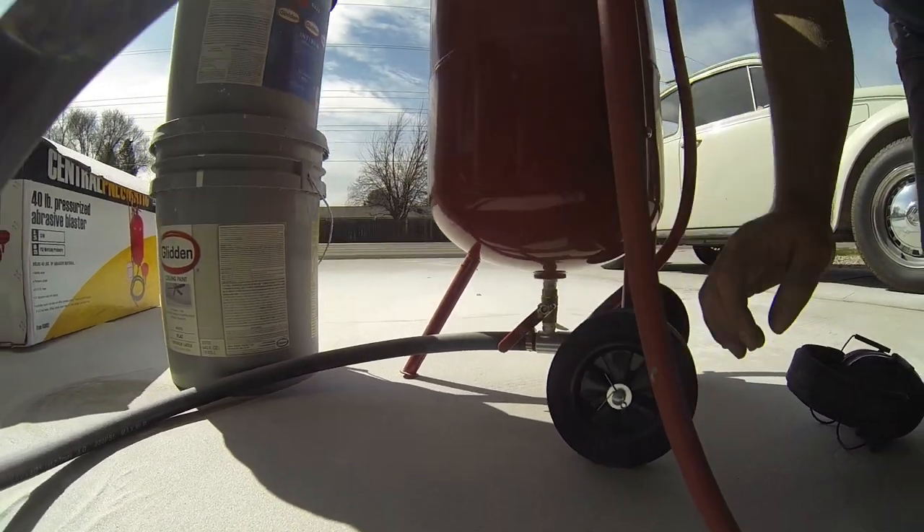I've been running this at 90 PSI and I've been having no problems after I found a couple key pieces of information. If you open up all the valves and you're only at 90 PSI using the standard nozzle, it's just gonna dump a bunch of media on your surface and not really have any pressure. So if you reduce the media flow and allow the pressure to stay high, it will actually change tone and reduce the amount of media going forth by a substantial amount. I went through probably 40 pounds before I figured this out. This nozzle here I have at about a 45-degree angle. Since it's Harbor Freight, it might be 30 or 50 degrees, but the point is I'm reducing the flow of media.